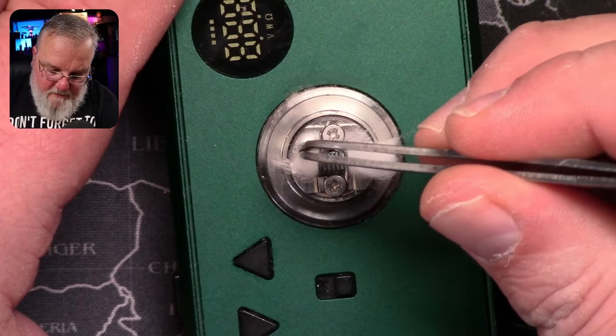All right, folks. As you can clearly see on here, they used a rose tool and cleaned off the one side. But the other side is nothing but a sloppy mess. You can barely tell there's a burr right there that we need to get rid of. So go get your old favorite Dremel tool. You can pick one of these up. This particular one came from Harbor Freight. It cost me $10. It comes with an assortment of stones and sanding discs and everything else in the world. A simple little job, but we're going to need to clean this up right there.